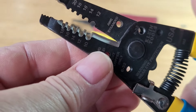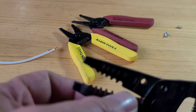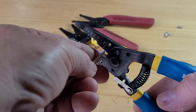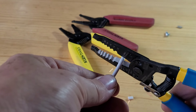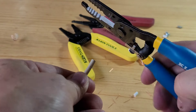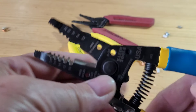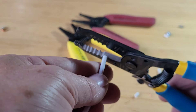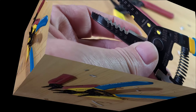And what I left for last to show you is its cutting edge. It's a cutting edge that I personally really liked — very efficient. It cuts very well, cuts very smoothly, better than many other pliers. The cut from this blade is sensational — I was impressed. You can also cut solid wires with it. However, you must be aware that it is indicated only for cutting copper wire. It is not indicated for cutting steel — if you cut steel, you can damage the cutting edge of your pliers.